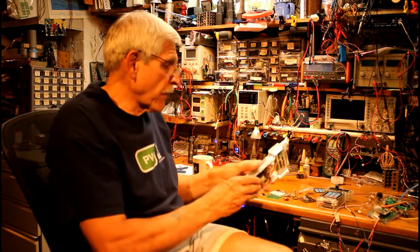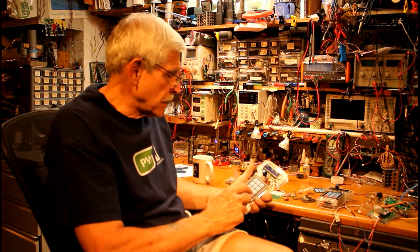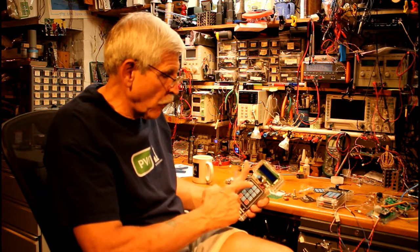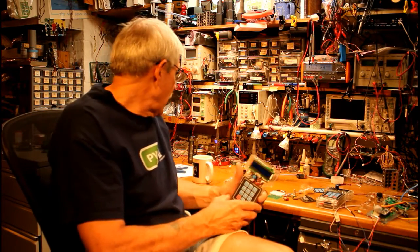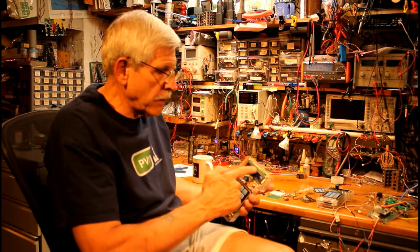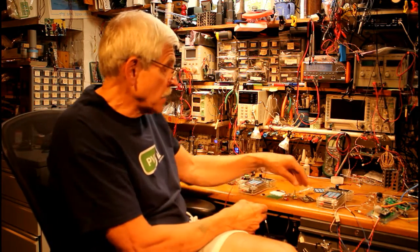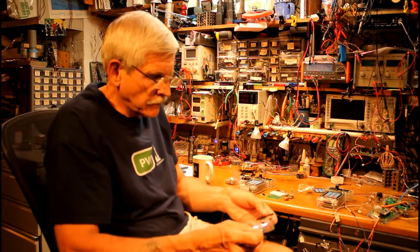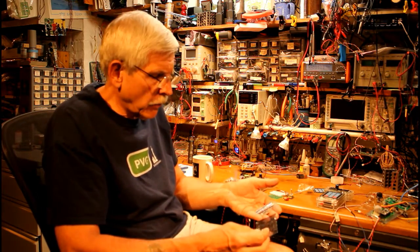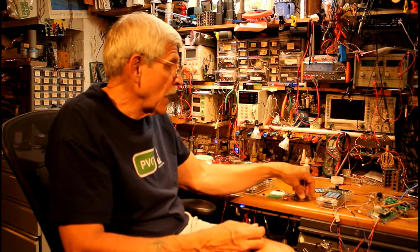This, again, is one of the throttles. It has a keypad on the front that's used to enter things like locomotive numbers, addresses, if you will. It's also used to activate functions. If you wanted to get the bell going, you can press number 1, and so on. The other thing that I didn't mention is it has a two-line liquid crystal display up here with an I2C interface that hooks up directly to the Arduino. Speaking of Arduino, it's a Pro Mini, very inexpensive and readily available. This is one that just came out of the bag, and I'll get that soldered up and ready to go.